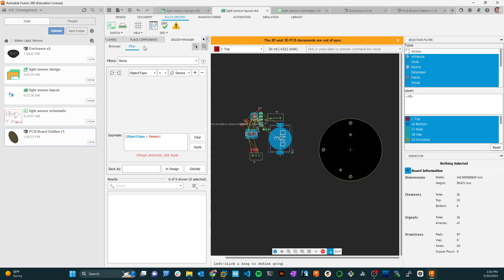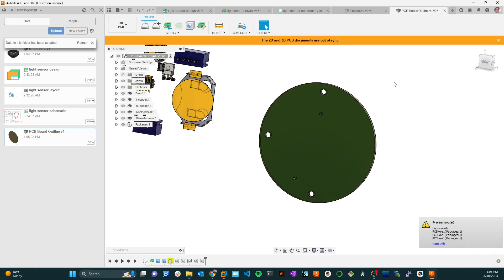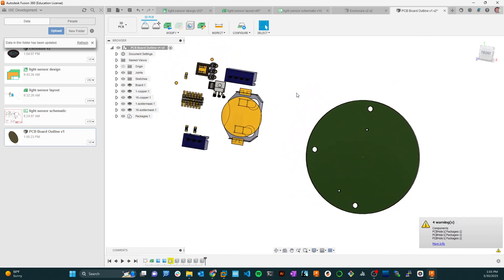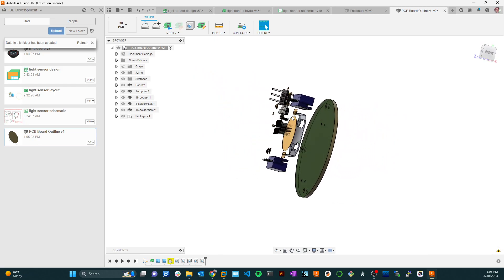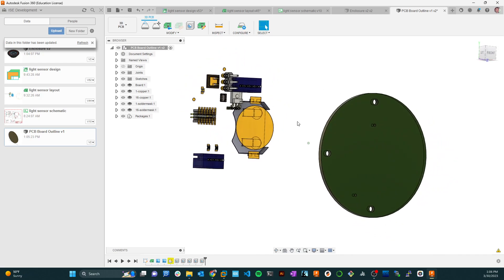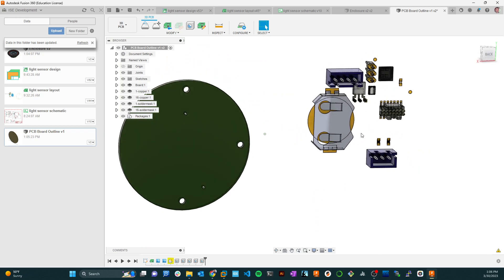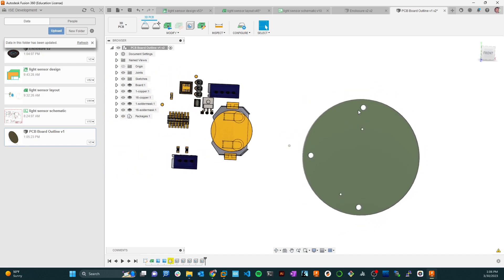Now I'll come up to 'Push to 3D PCB' — it's going to push the 3D models from all these parts to the PCB. Those parts are sitting off the board so it won't be exactly right, but let's go ahead and push it. You'll see it pulls everything into our design — they're kind of sitting off the board, some upside down because they go on the other side. I've done some editing on these files so you might see them differently on your system.